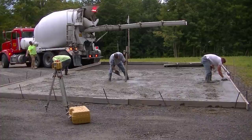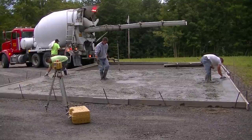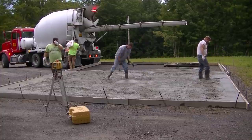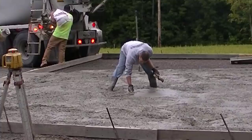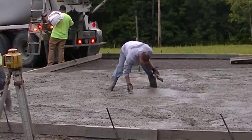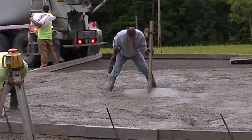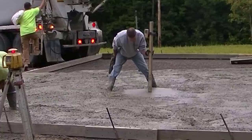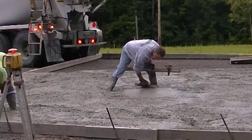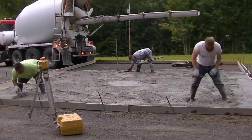I'm using my laser — that's a Topcon self-leveling laser. I've got a link for that down in the description if you want to check that out. That's the one I recommend for doing concrete work and earthwork; it's definitely the best one for the money. I'll use the laser with my grade stick and the receiver, and I'm going to set that wet pad to the same level as my exterior, so this slab is going to be perfectly flat when we're done. When I have it right where I want it, I put a little X on the pad to let everybody know that's to grade, and then we can screed off from that.